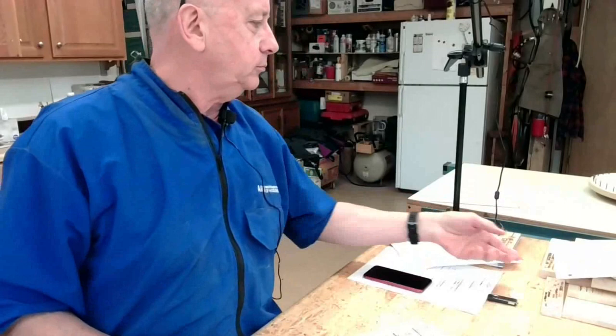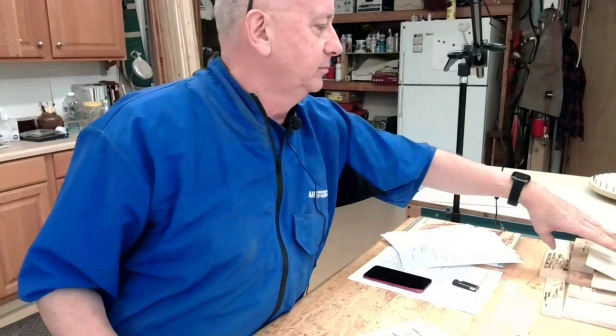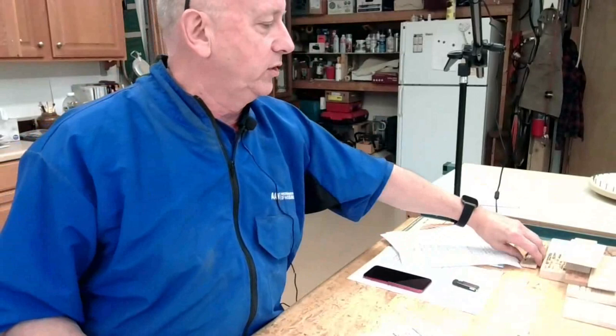The wood selection. Everybody here is familiar with the different common woods that we have, and that's very important to have good results, especially early. I would recommend you get some basswood. Cherry is good wood. Pine is kind of okay, but pine will have that early growth, late growth, that does mess with your consistency. Avoid ash, avoid oak.